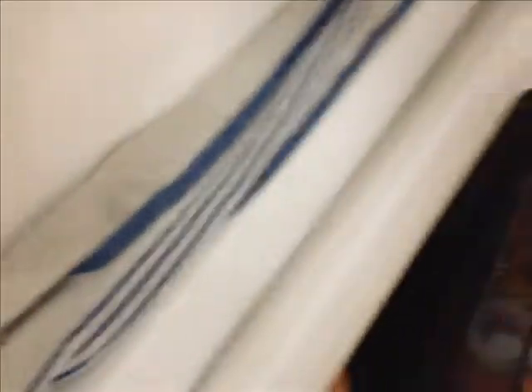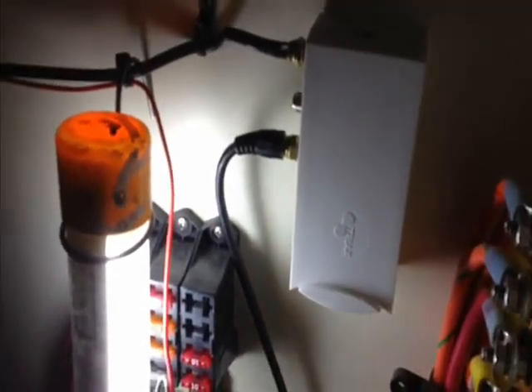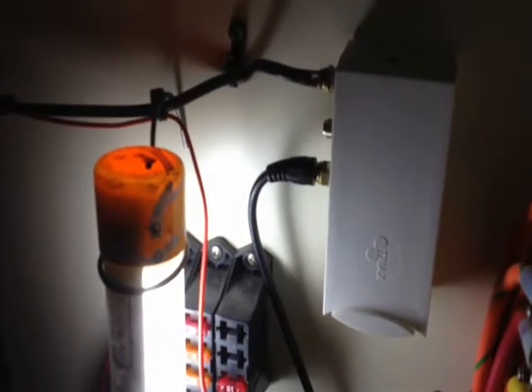Let me show you why I originally made this video. Here we are inside the electrical panel, and I'm going ahead and removing this device right here, which is the amplifier for the terrestrial TV antenna. I didn't notice this until I started clipping wire ties, but here is the red wire that I have in my hand. There is a butt connection here, then another butt connector, a fuse holder, another butt connector, another butt connector — finally going into the connector that plugs into the top of the terrestrial TV antenna amplifier. That's 1, 2, 3, 4 butt connectors on a wire that's probably not 3 feet long.